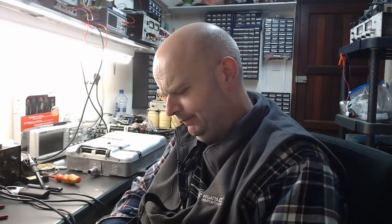So, what happened was, around the end of November, beginning of December, the land yacht decided that after 5 years and 84,000 miles, the brushes in the DC motor had pretty much crapped out. And I decided at that point, well, surely I can just do a quick AC motor swap in there. And that project ballooned out quite a bit. I did get it done insofar as I was able to drive the car away in 2 weeks' time. So I was quite pleased with that.